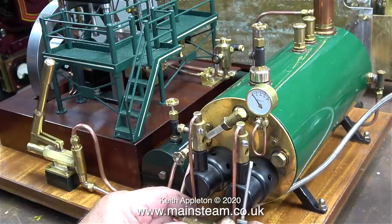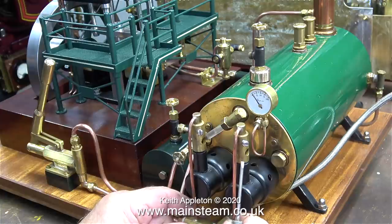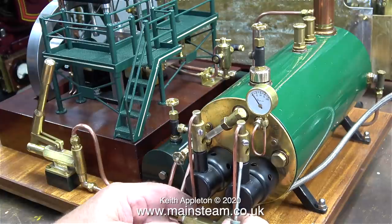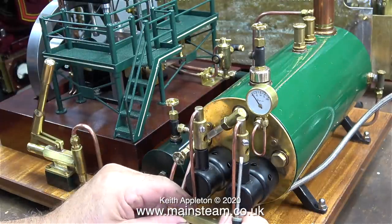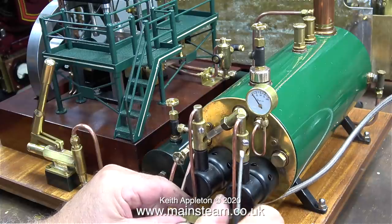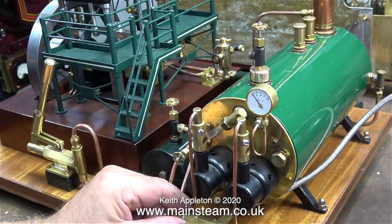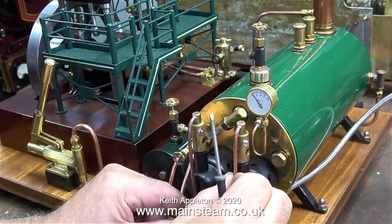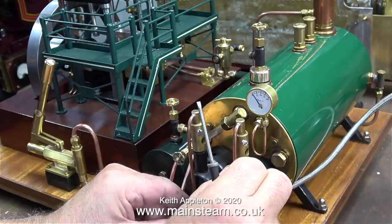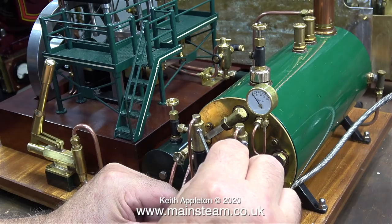But it's not really the answer. If you push the jet holders quite far down in the Venturi, yes the howling stops, but the smell from the chimney is intolerable and the carbon monoxide alarm would soon go off. With Mack steam boilers made by a man called Mike Abbott, he used to supply a sliding sleeve, but this isn't the answer either. I must say though, the howl sounds very good — a bit like a steam locomotive whistle. Pulling the jets right down in the Venturi stops the howl but the smell from the chimney is really, really bad.